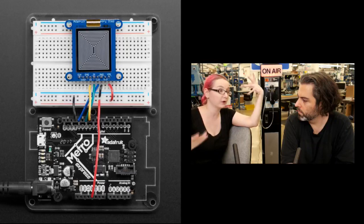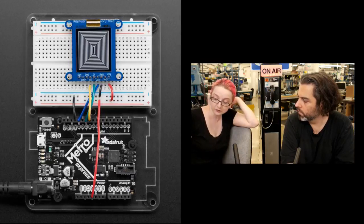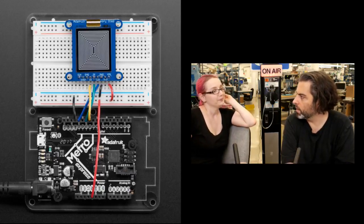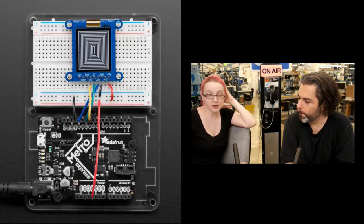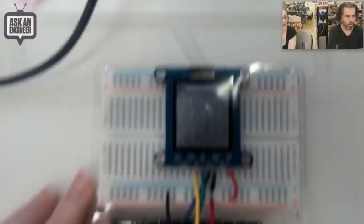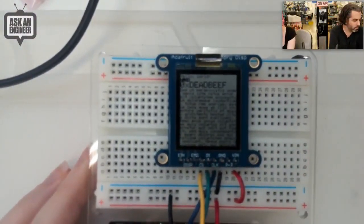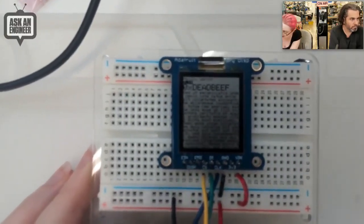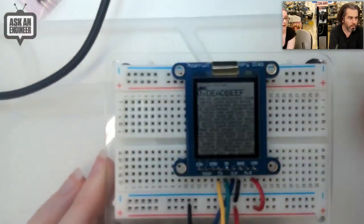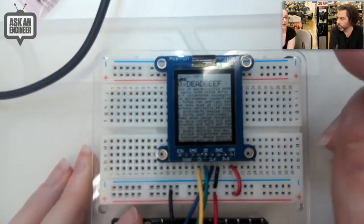You have to use something with an M0, an ESP8266, an ESP32, a Teensy — something with a bunch of RAM. Now it's actually not a big deal. Almost all chips these days, except for these kind of ancient AVRs, have at least 4K of RAM. So not a big deal. Just watch out — you can't use this with your older Feathers or older AVR microcontrollers. I can show this on the overhead. This is a pretty cool display — it's kind of a cross between e-ink and LCD, and it really is a very sharp looking display.